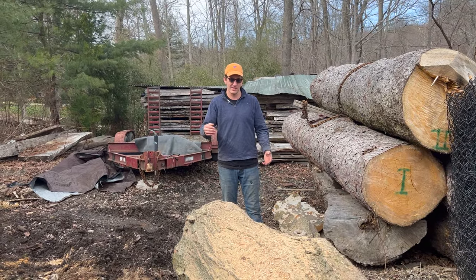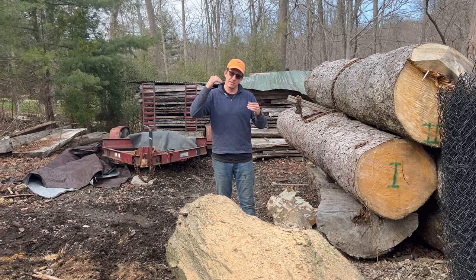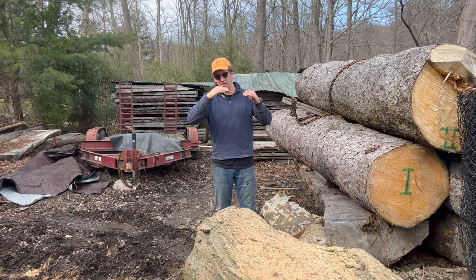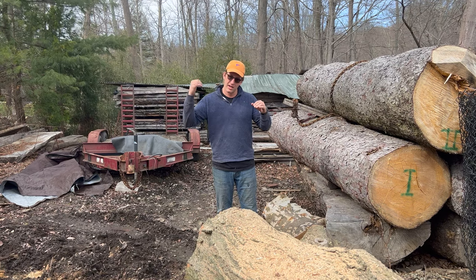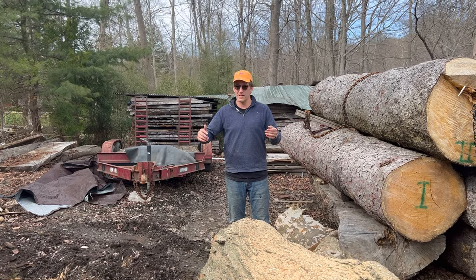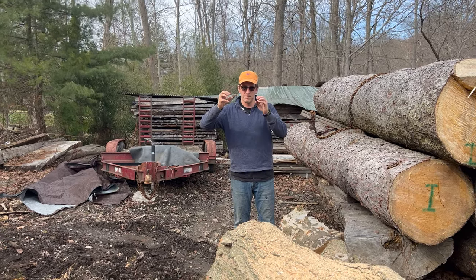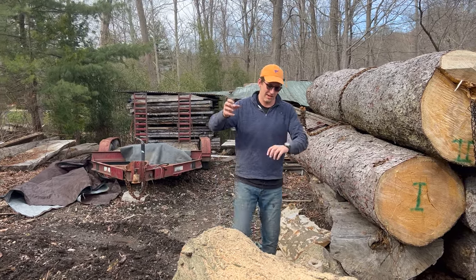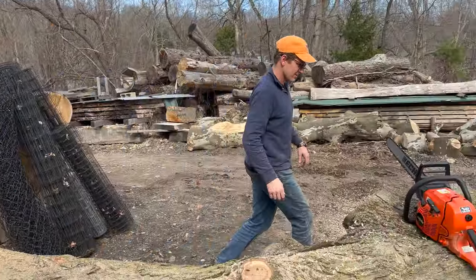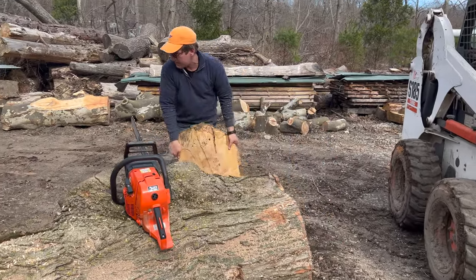Normally, I like to cut into the even or most even side of the log because that allows the blade to enter most level. So there isn't any sort of inequality that then gyrates throughout the saw as it goes on its cut, because things are moving at whatever it is, 90 or 110 miles an hour. And if it picks up any momentum that deviates from the straight cut, it'll actually increase over time, and it can cause fluctuations in each cut. Absolutely, yeah.